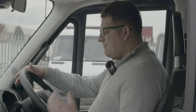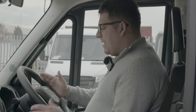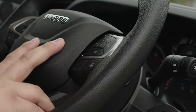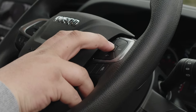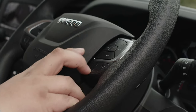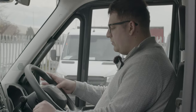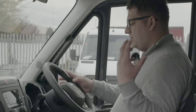What you need to do next is very slowly release the clutch. It will now make that noise — as you can hear, it is now sending power to the PTO in the rear. The next thing you need to do to get power to the rear is press the cruise control button on the right-hand side center. Press that button, then press set plus. This is going to increase the revs. We're going to put it to 1050.